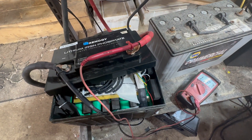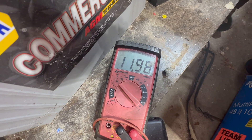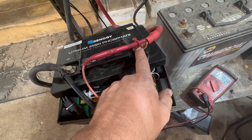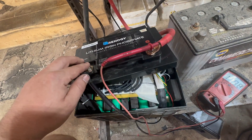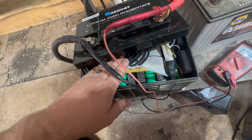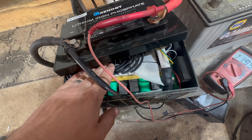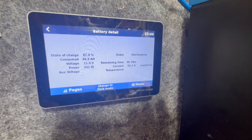Not exactly at the terminals, but I imagine there's not a lot of loss between these. It's good to check that — but if there was significant loss, these connections would be building heat, and they're not hot at all. All the cells feel pretty cool. The BMS is getting a little warm, but if ambient is 70°F, these are mid-80s — not bad. So I'd say that voltage reading is pretty accurate.